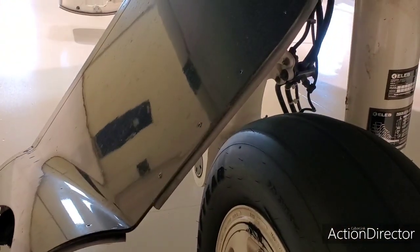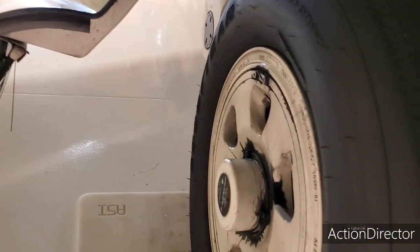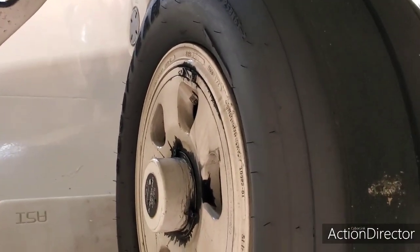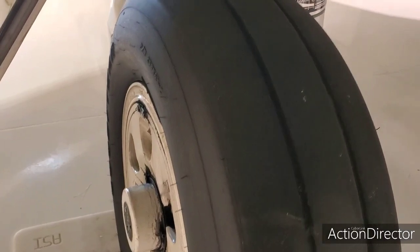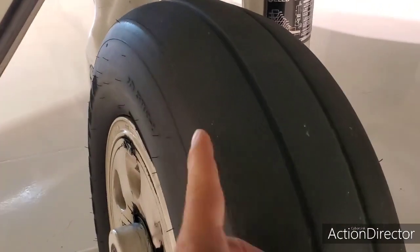Last one was at 170, so we put it up to 178. Something to remember about these tires: if you run them 10% low on inflation — so 17 PSI low — they're considered unserviceable and you must replace them. Just food for thought there. They also say you can run with cord showing 20% of the radius, which is 11 inches of cord on the tire in the maintenance manual. I don't do that, but that's what the maintenance manual says. They're very worried about sidewall failure — you want them low, you have to replace them. You can run them a long time until you get 11 inches of cord showing.